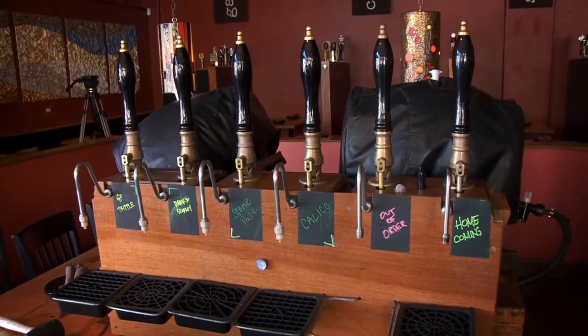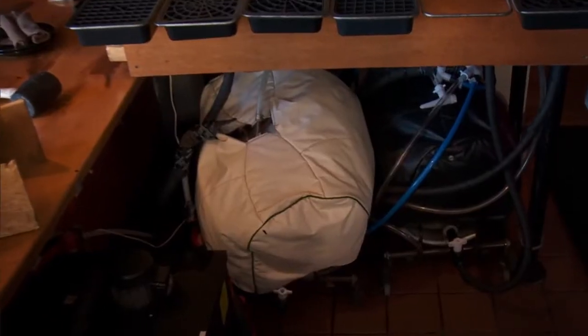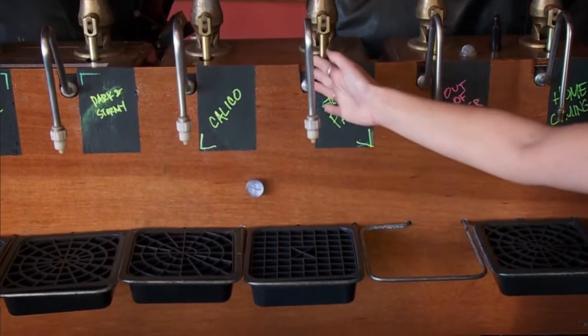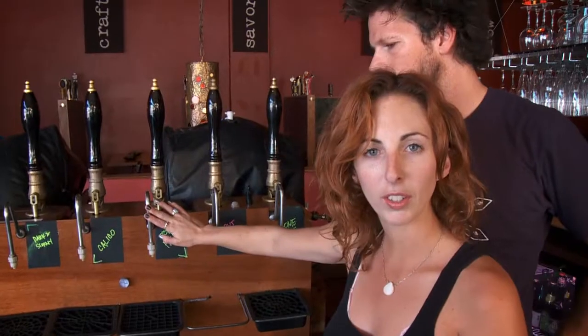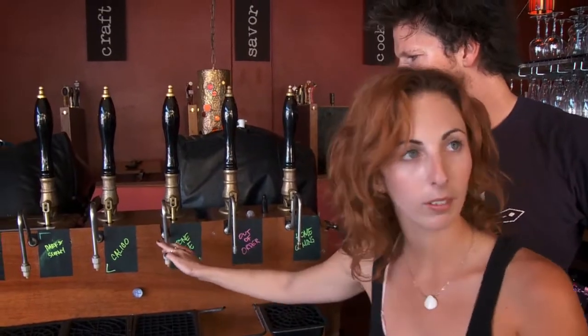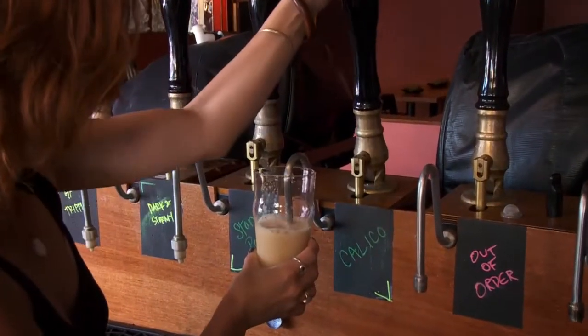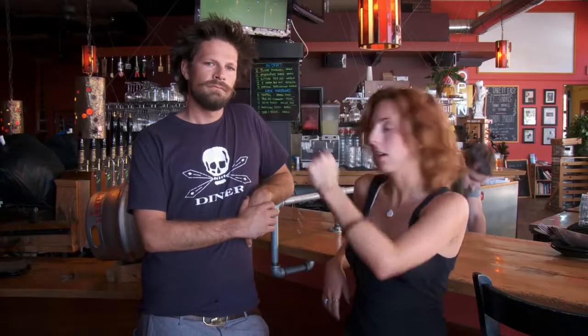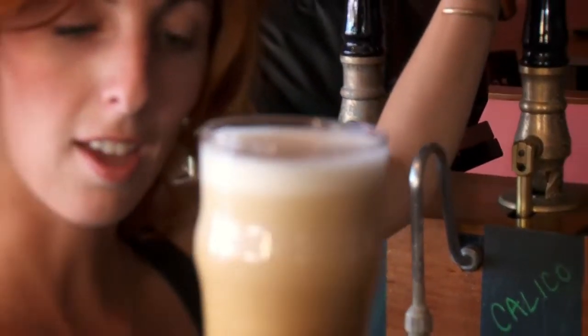It's the Kaskinstein — a hand-built system. There's glycol running through all of these lines and the copper coils blanket the cask. We've actually even lined glycol all the way in this box, so it's chilled to about 55 degrees all the way up until it gets to the tap right here. In a cask-conditioned beer, you have to hand pump it because you don't have CO2 to force it. You just pull the hand pump and you get that nice fall, and it's ready to drink.